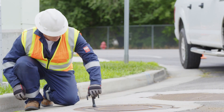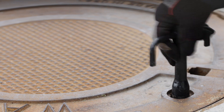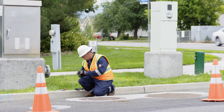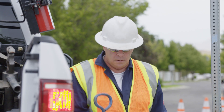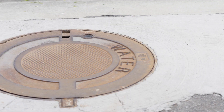Turn the cam lock wrench counter-clockwise to engage the lock. The wrench is only removable in the locked position, which ensures that the lock is engaged when closed. Replace the plastic cap to minimize debris. Since the bolting is already lined up, maintenance crews don't have to spend extra time trying to align the holes.